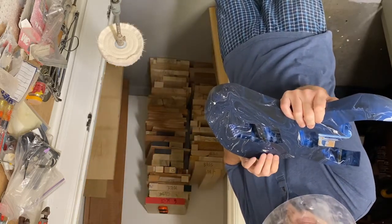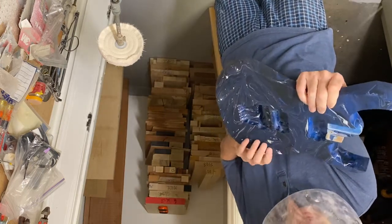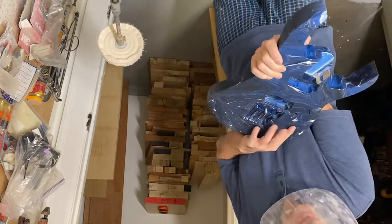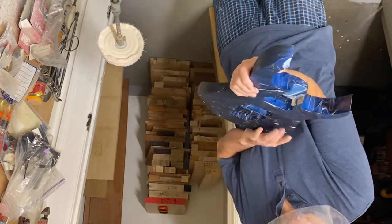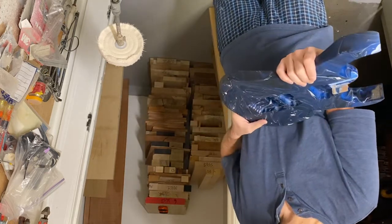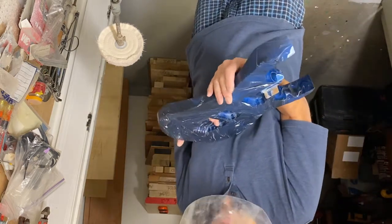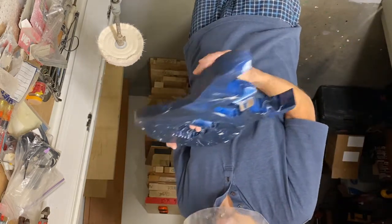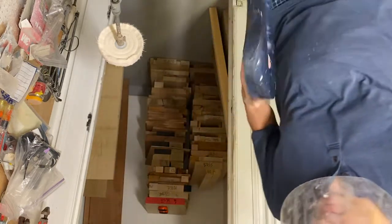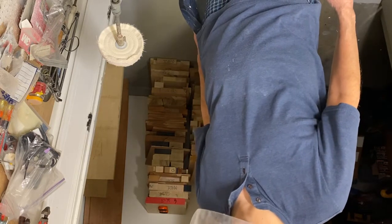So the thing that I found that has been really wonderful on that was putting super glue on the back of that and the front of that before we even do the prep, and it keeps that part of the wood sealed, and that problem has gone away. So I have a text blog that talks about that. So I'll show some of that when I do some preps. If the coronavirus goes on long enough, you'll have videos of everything.